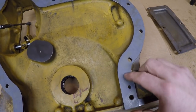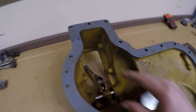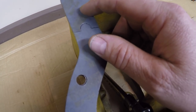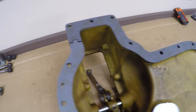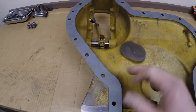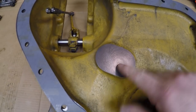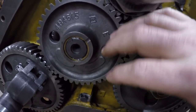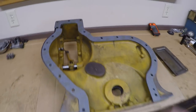Looking at the back side of the cover — I made this gasket. This is another one that's not available from Cat anymore, and my bulk material wasn't wide enough to do the whole thing in one piece, so I did have to put a joint in it. I did a little puzzle-piece kind of design right there to help it mesh together and keep it from blowing out. I'll use the usual sealer and make sure to fill that joint area — there should not be any leakage to worry about. This is another gasket where you want to very closely replicate the thickness of the original, because that flat machined area right here is your thrust surface for the idler gear. You don't want to get that gasket too thin and mash that cover into that idler gear and start to bind things up — that thing could run hot, gall the surface, and give you some serious problems in short order.